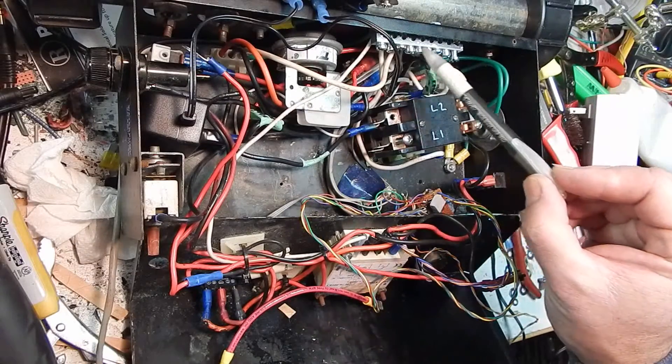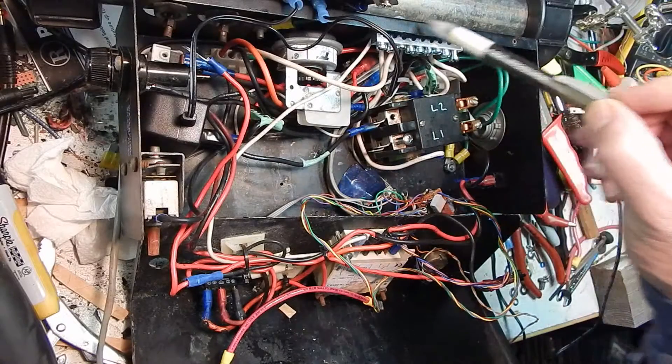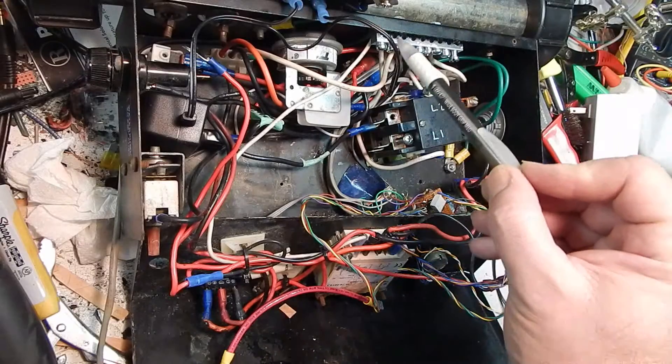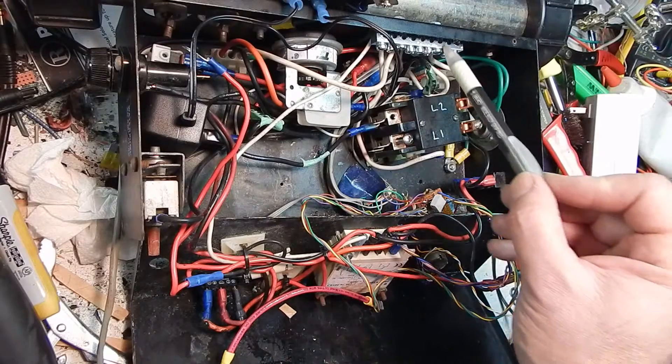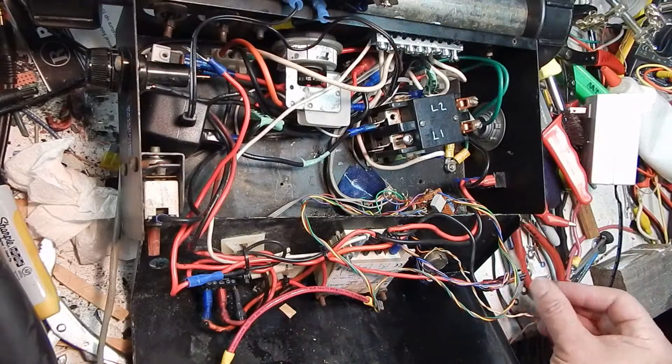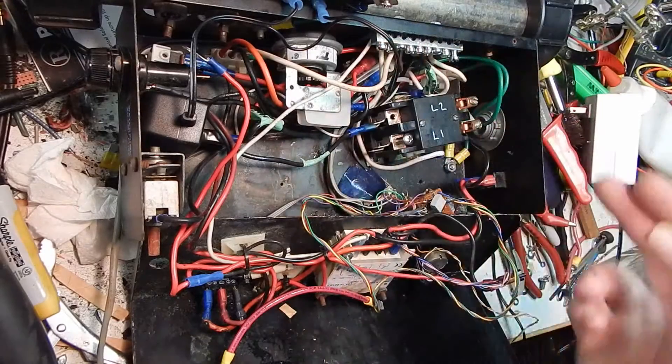This strip is actually not mounted directly to the wall here — it's mounted with insulated washers, so it's not directly connected to the grounded chassis. Because this is an electrical box, I don't really want my neutral and ground together at this point. I'm afraid it might interfere with how the GFCI is working — maybe changing or shortening my loop or unprotecting part of the loop. So this is actually a floating neutral.